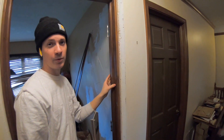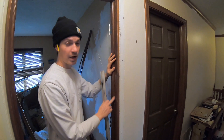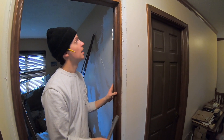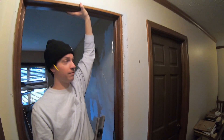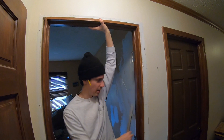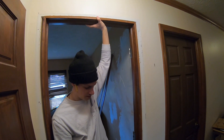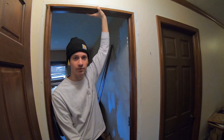There are a couple different ways to start. You can either start by trying to level out one of the sides — if you're alone, that's probably your best option. What I like to do is hang the top of the door jamb first. Typically that makes it a little bit easier to get these sides parallel to each other, and it also allows me to make sure that the door when it closes is not going to scrape on the carpet or the floor.